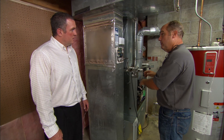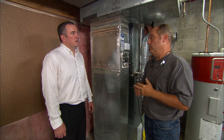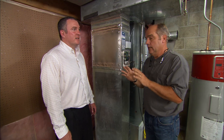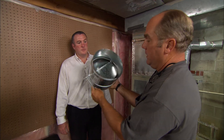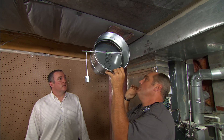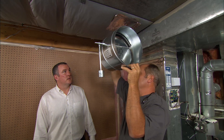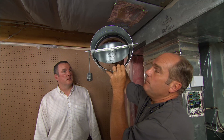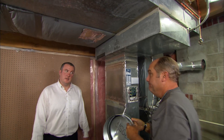Whenever we add zoning, there's one more very important thing: the blower is sized for all those registers, and now we're going to close off half of them. Too much airflow through the remaining registers causes noise and whistling — that's not good. So we need to put in a bypass damper. This weighted damper installs between the supply trunk and the return trunk. When the blower runs and half the zones are closed, pressure builds up; instead of fighting through the registers, the air lifts the bypass damper, returns to the return trunk, and keeps things quiet.